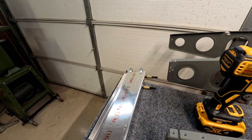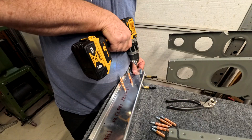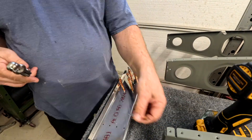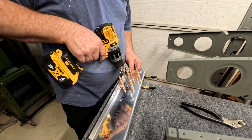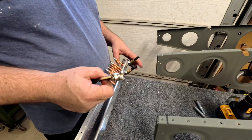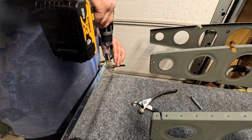This is the very end doubler that goes on the far side. I don't know the engineering behind it, but they have you cut the tab off of that last rib, and you have a doubler on the rear spar. When you hook the rear spar to the rib, you don't actually hook the rear spar to the rib — you hook the aileron attach bracket to the rear spar, which then attaches to the rib. It's kind of crazy that way.